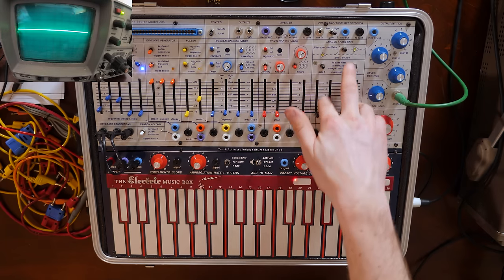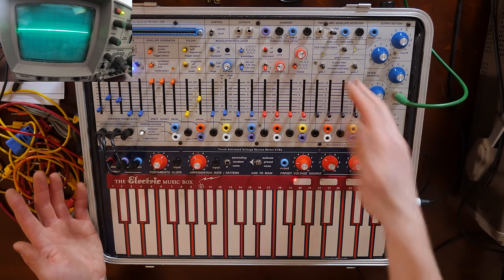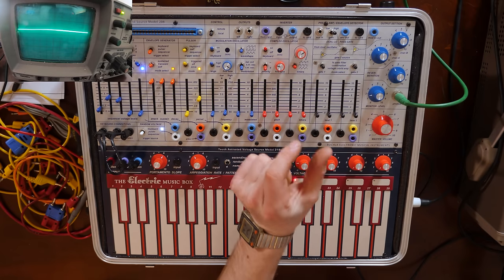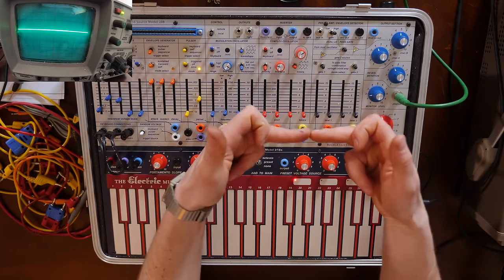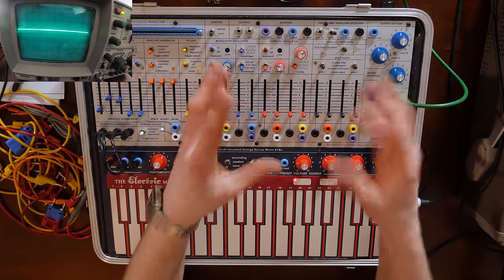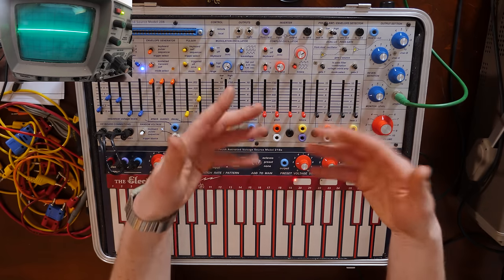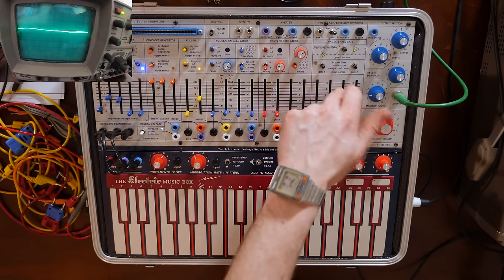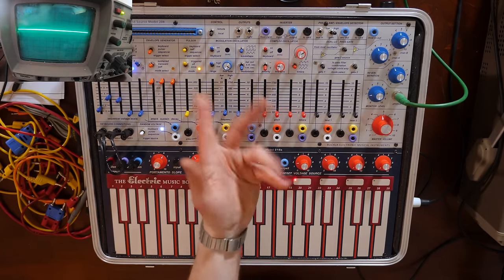Then we go over to this last section, which isn't like the low-pass filters in Mini Moogs of the time and ARP 2600s. This is the low-pass gate. You remember around the back there was these big chunks? These are called Vactrols. Basically, what those are is LEDs and light-dependent resistors kind of plonked together. Unlike the solid-state way that the voltages in the filters were controlled in other synthesizers of the time, this was controlled by those Vactrols. That gives this a very funky sound, and as we play it on, you'll notice that funky sound effervescing from it.